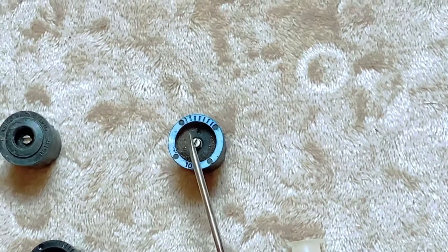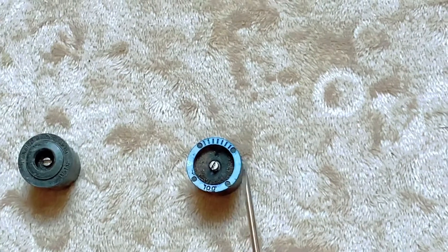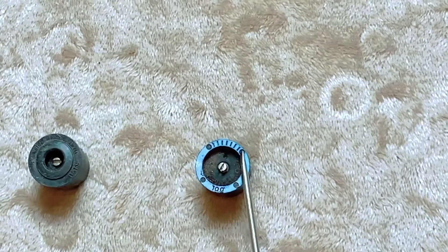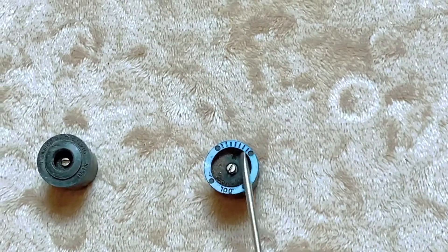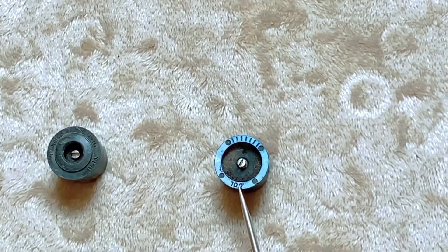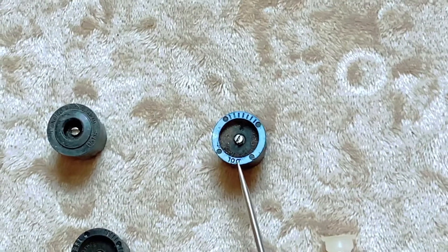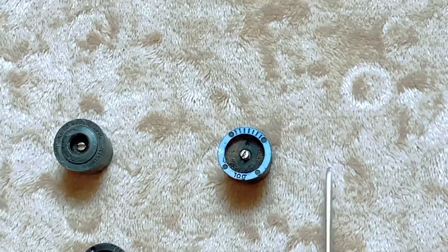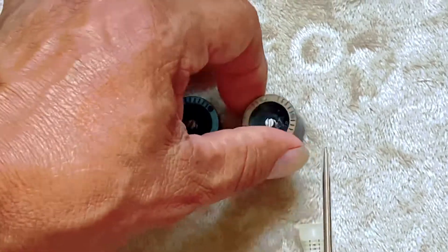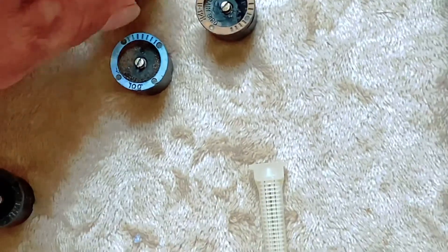This nozzle is at a 90-degree or quarter spray. You can see the pattern lines right here which tell you what it is. There's also the distance — this one would be 10 feet, then you have a 12-foot, and this one is a full 15-foot.